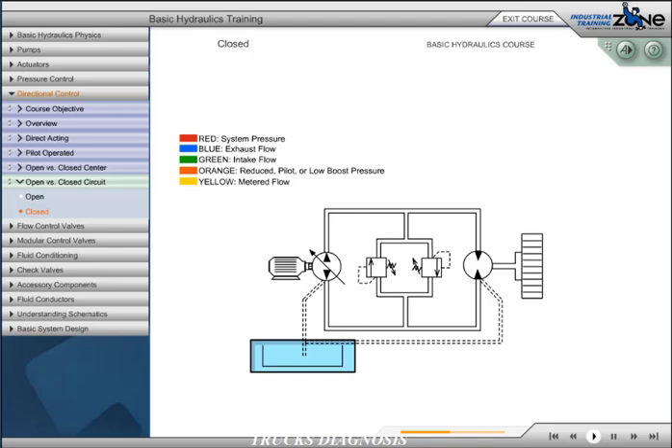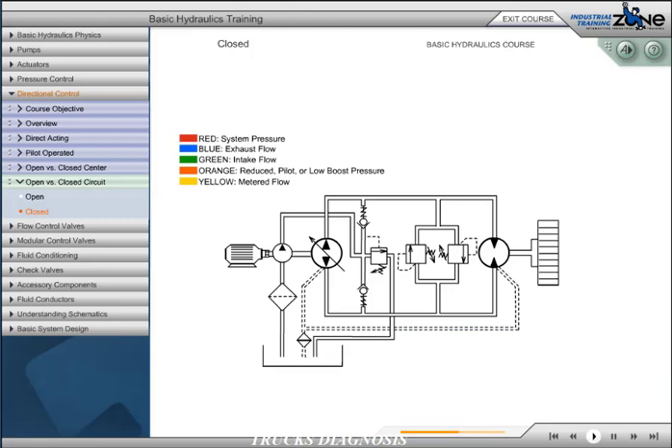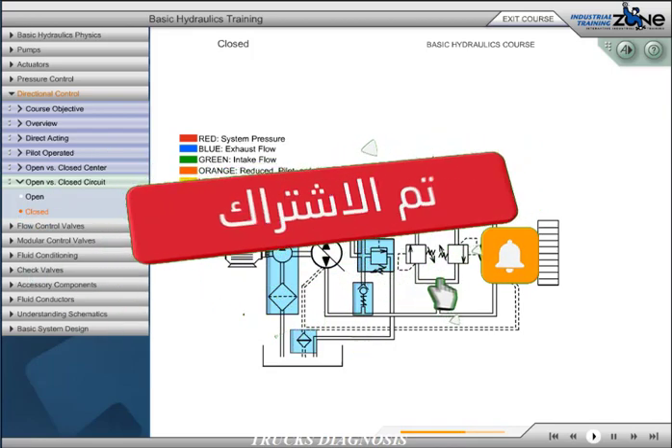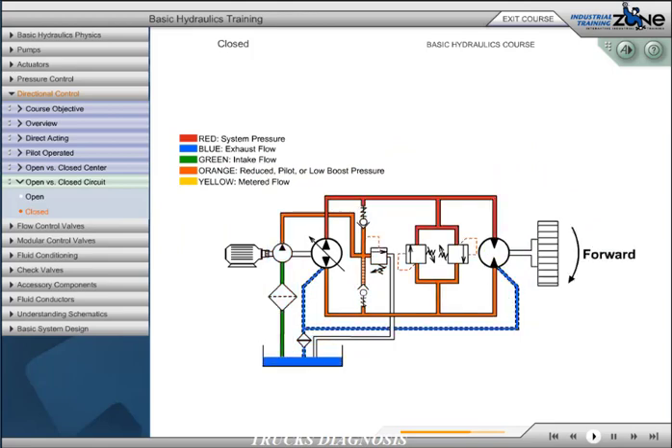This circuit adds a small tank to hold the leakage from the pump and hydraulic motor. This leakage must be replenished to the closed circuit. In the last circuit, a fixed pump is added with a filter in the suction line. Two spring check valves and a charge pressure relief valve are added, and a heat exchanger is added to the leakage line from the pump and hydraulic motor. The fixed pump replenishes the hydraulic fluid lost from internal leakage through the spring check valve into the low-boost pressure line. The other check valve keeps the high system pressure isolated from the low-boost pressure. When the auxiliary pump has replenished the low-boost side, pressure builds slightly, opening the charge pressure relief valve. The charge pressure relief valve opens, directing fluid back to the tank, and maintains a constant pressure in the low-boost pressure line, which charges the pump.